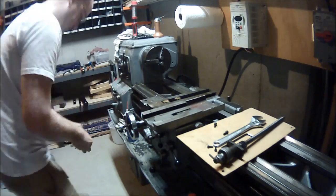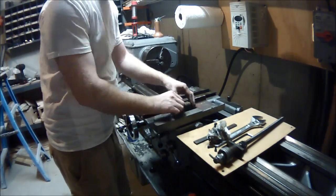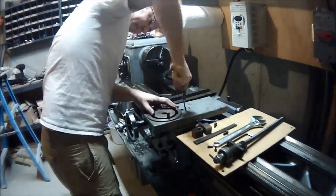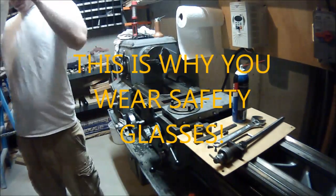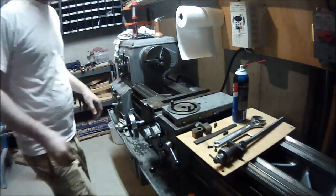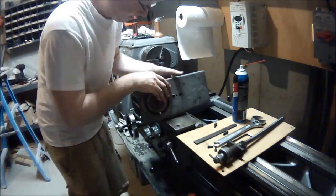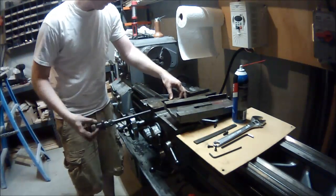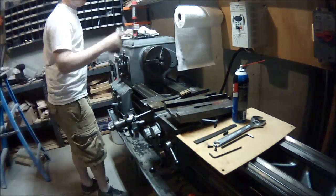Here's what I learned, which should be invaluable. Both of the nuts have a slight dent, and those dents go together facing each other — something I thought of while doing it the first time. Also, they had painted over a set screw hole; the set screw wasn't there and the hole was filled with metal shavings. I cleaned it out and understood that by putting the set screw in and tightening it down, it pushes the two nuts apart, which tightens up the backlash. So both nuts had the indent facing each other.